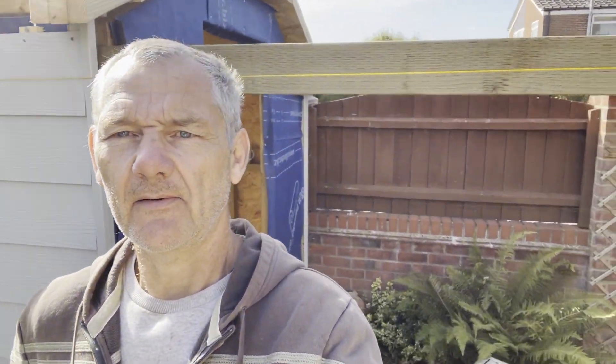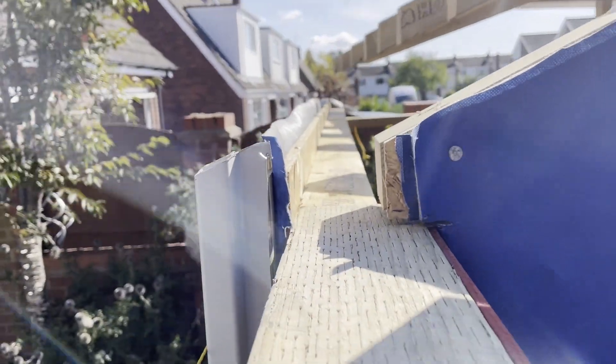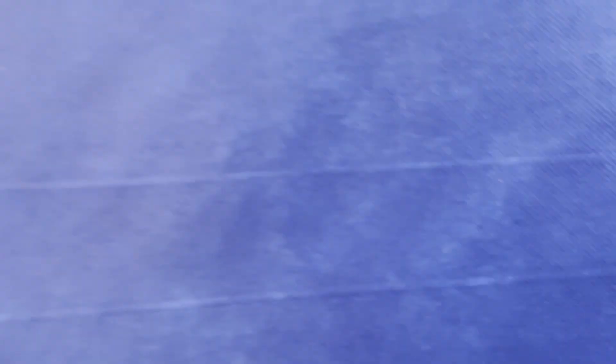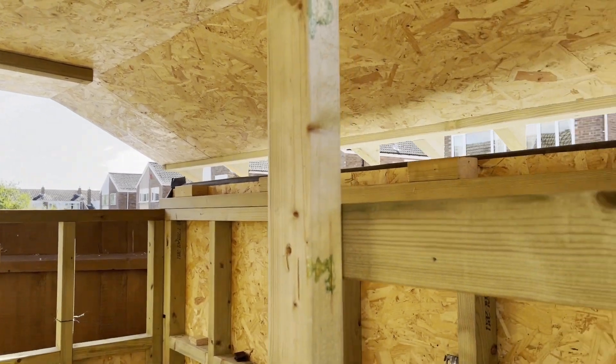This is the exciting part now. I've got the rails and posts in place — the next step is to fit the track on the top and the wheels to the roof, and I'll finally get this roof moving. I need to jack the roof up so I can get access to fit the track on top and screw the wheels to the underside of the roof on each side. I'm making up some props and then we're going to lift the roof up and move it out of the way. I've jacked the roof up and exposed that side — the plan is to get the track on there, fit the rails on the underside of the roof, then move the whole roof over and do the same on the other side.